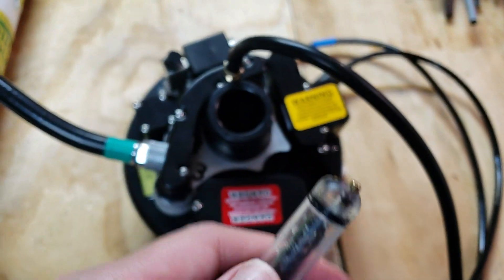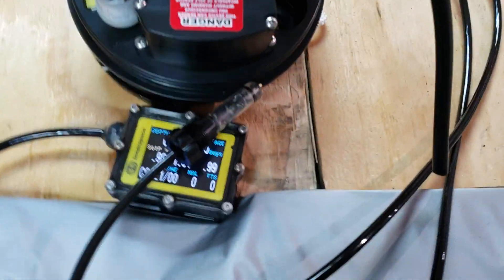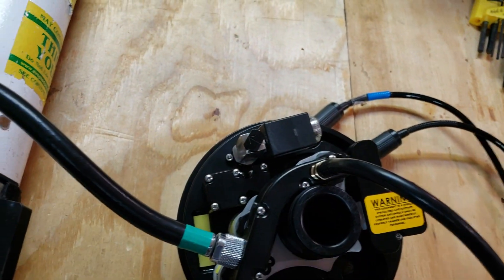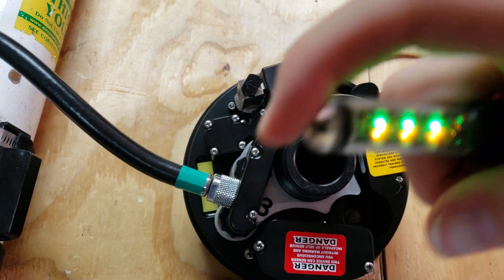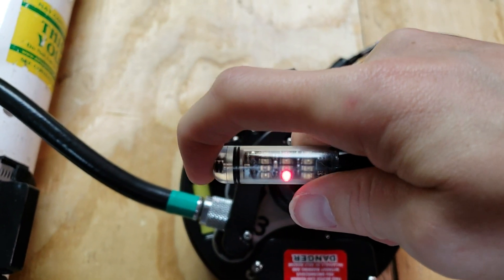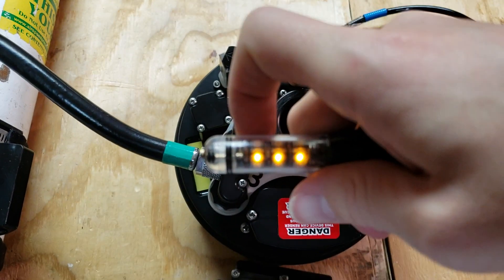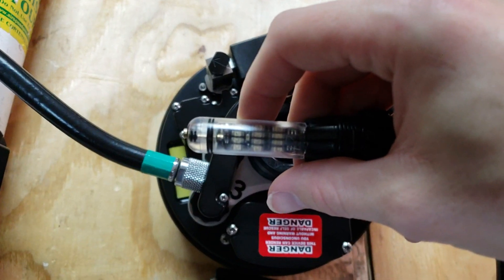With the HUD we need to go into the menu. Okay, we're in the menu system. We need to go to column 2 — so 1, 2 — and then we're going to hold that down for three seconds and it's going to go through the calibration.